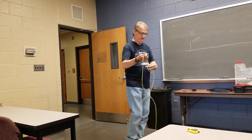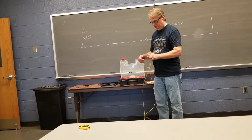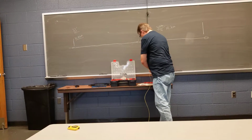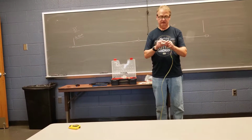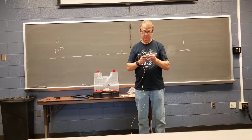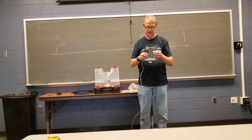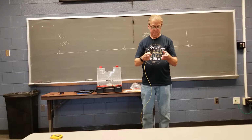On the ends, the whole story is just take one of the jobbers that I passed around and put one of these on that. Rope goes to the other side, and that's what you tie it off with. It won't be in tune. Use your antenna analyzer, or an SWR meter if you want to play around, and that'll get you on the air in 20. You'll probably have to shorten it a little bit.